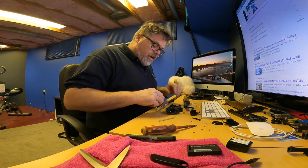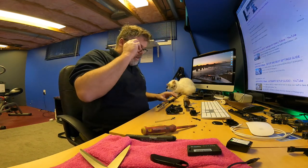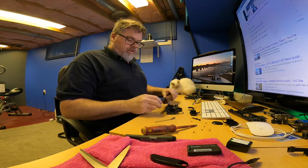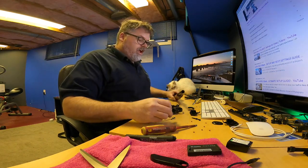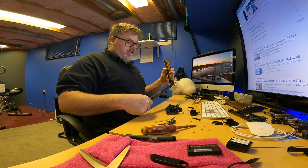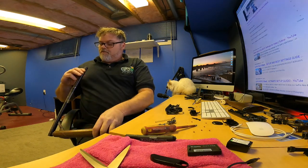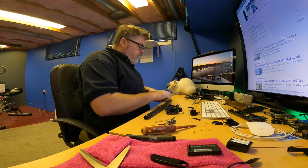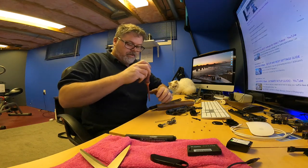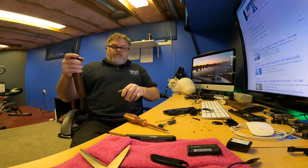This is spring-loaded, so that obviously goes on here and in there somewhere. Let's put that aside for a minute because my main concern right now isn't that part — it's this part. We don't seem to be getting any kind of air build-up on this mechanism in here. I can already see what's going on; something's not moving in there that should be. We're going to have to knock this pin out and get all those parts and pieces apart. I'll be right back — going to go knock that pin out.